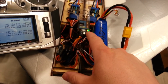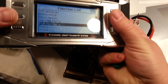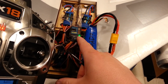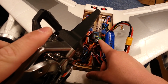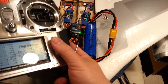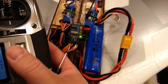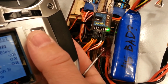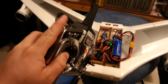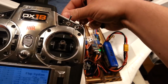Okay? So you can see we're off right now. Stabilizer's off. Now it's on. Now it's on. But we still have play within that range. Okay? I hope you guys are picking up on what's happening here. Now I can clear that to zero. Okay. Stabilizer's on. See, it's on still. So now we just need to find the range. Okay, so I want to set the neutral setting until that light turns to just green. Yep, there it is. So that now we're always on. Now the stabilizer is always on. Okay? Always on. And then, of course, we can adjust the master gain.